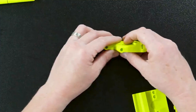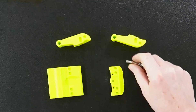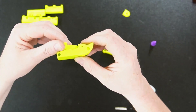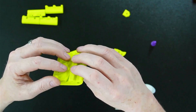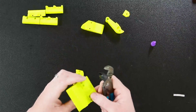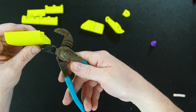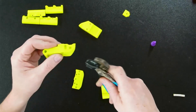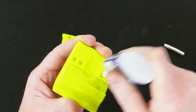Do the same thing to this side. From here we're going to install the magnets and press them in. I like to add a dab of super glue anytime I put these in just to make sure they hold better - the best super glue you can get, go to Magnet Baron. Make sure when you put these magnets in that you get the polarity correct on each side, otherwise it's going to push against each other. I like to use Old Lemury 3D's famous magnet pressing tool - put tape on the bottom side so you don't tear anything up, put your magnet on top, and press it right in.